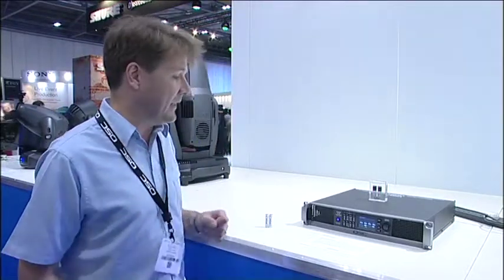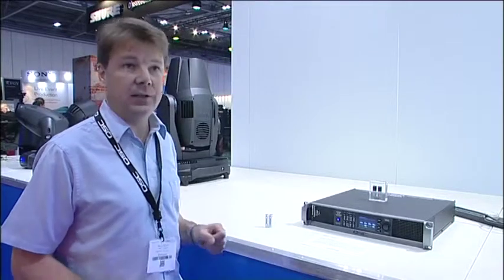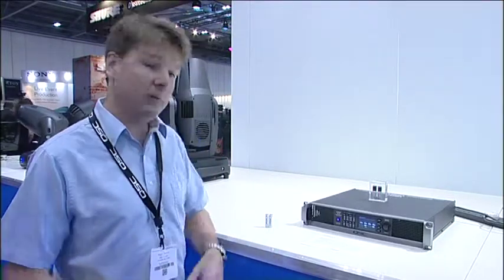Lastly, if we needed to have all of the power coming from one channel, we can combine these channels together with two in summed in parallel with another two channels in summed. And that gives us 5,000 watts available in the four to eight ohm region, which is incredibly useful — that's where most loudspeakers reside. Of course, we could figure it the other way and have the same power running down to one ohm if we so wished.